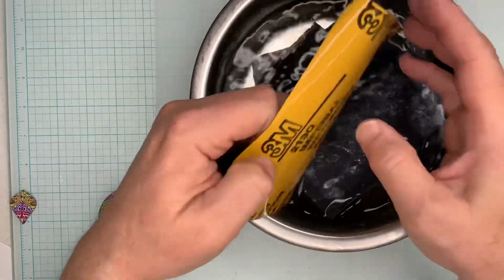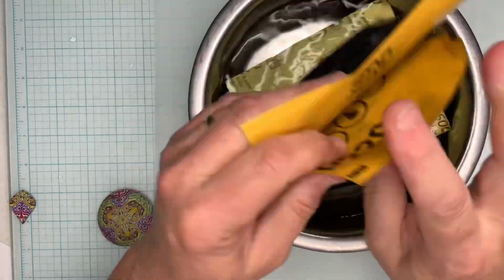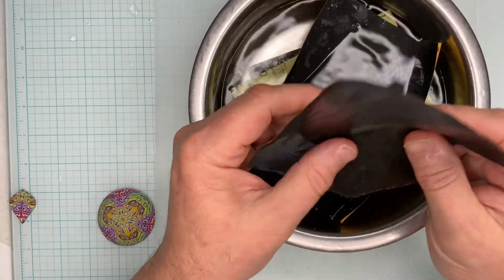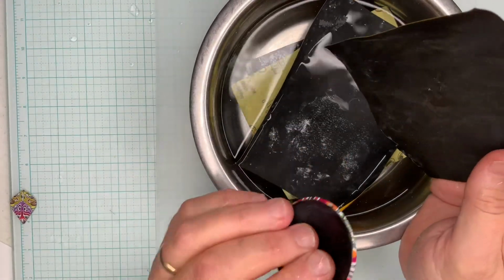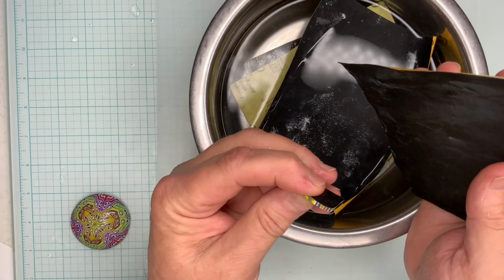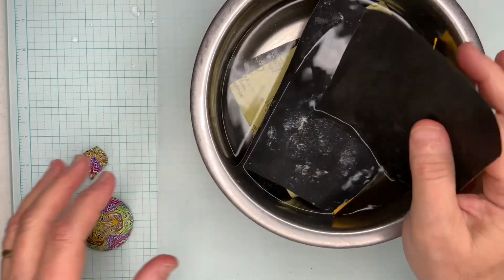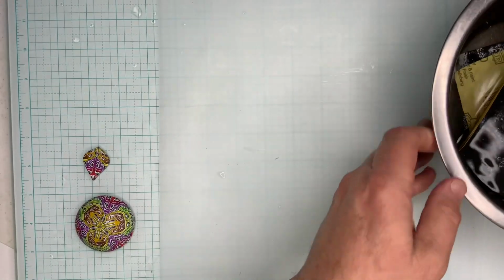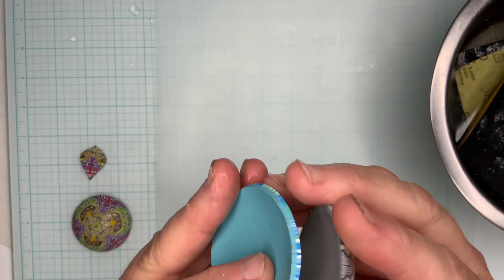Now, of these sandpapers, 220 grit is the coarsest. It's super coarse. Never use 220 grit on the surface. It's only for really bad edges. I wouldn't even use it on this. It takes too much off. 220 or anything under 400 is only for heavy removal, never the surface.